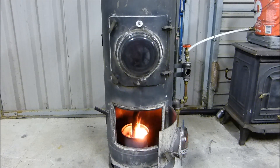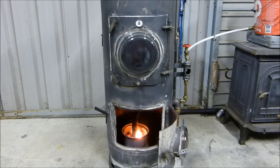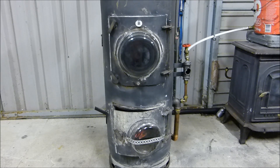I don't really need to modify it — I'm just playing around at this stage. This thing works like I wanted it to. Anyone else who wants to try it — that's just one-inch pipe. I have quite a few videos on how to make the burner, and even how to cut the propane tank, if you want to end up with what I have here. The glass door on the bottom — I just wanted to see what was going on inside that pot. I had a damper that I could use to regulate the air going into it. I took that off and put the glass on temporarily, but the glass will be coming off and I'll put that restrictor back on. Very, very good — really good little setup.